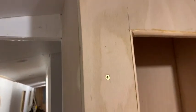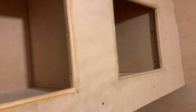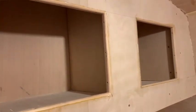and you can see that I've just lined the ply with a little bit of oak edging. I'm going to sand all that down now and fill it, because remember ours is only a painted finish, so it hides a, well, I say a multitude of sins, but you ain't got to be quite so precise, because nothing a little bit of filler won't put right. But there you go. Right, let's make the doors then.